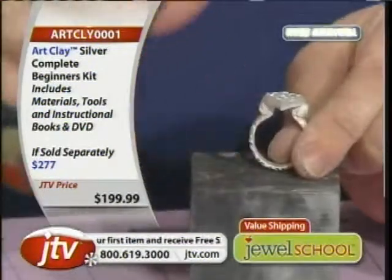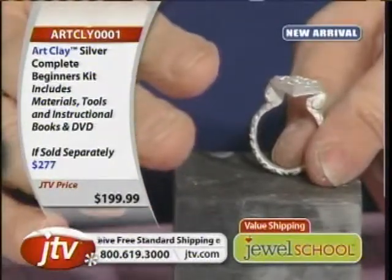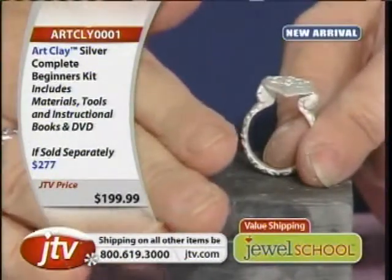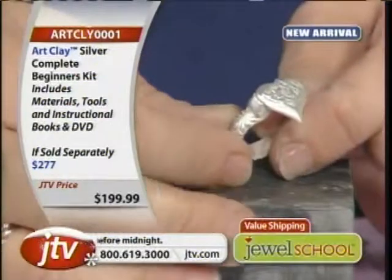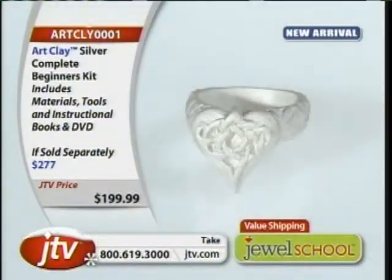The reason it was white — the white is not ash, it's not a coating on it. The white is the silver particles standing straight up. The more you flatten them, the more you shine them, the shinier the piece gets. That's incredible. So this is now 99.9% pure silver.